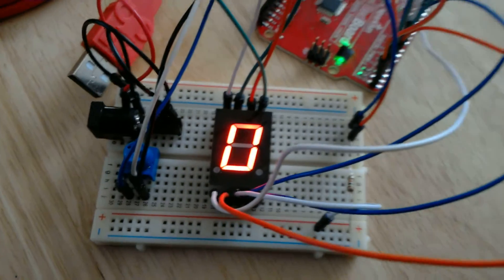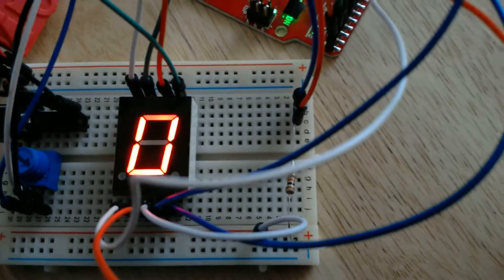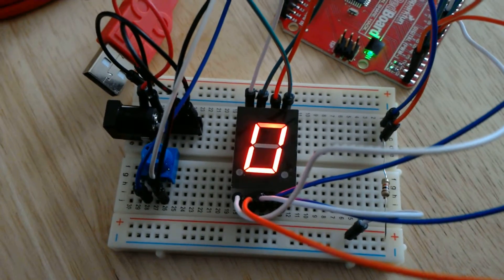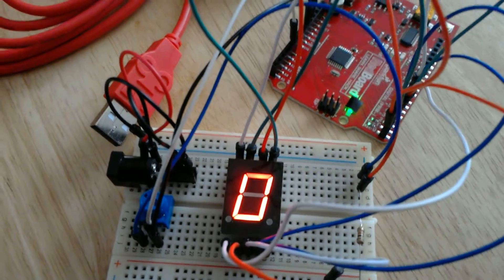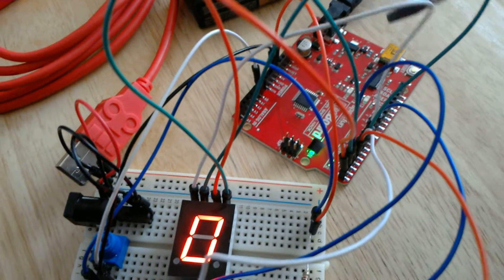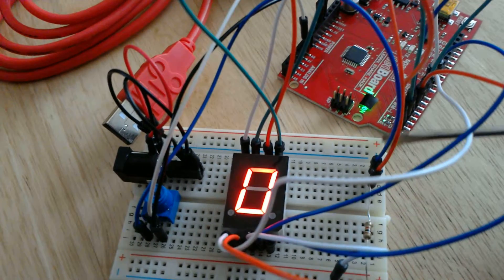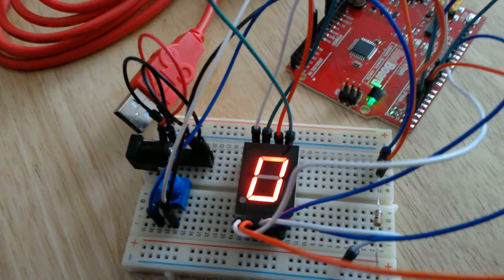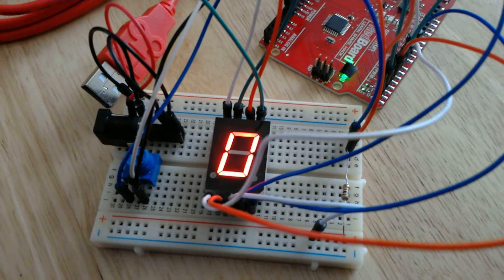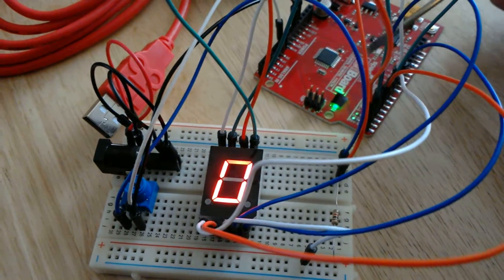That gets the resistor, which is nice — it means you don't need a resistor on every single input, you can just use one resistor. That's a 1000-ohm resistor. I have my power coming in from the board — the 5-volt power — going through the orange wire. I've got one branched off with the resistor and one without. That blue wire goes to the pot because the potentiometer doesn't need the resistor value — I tried it with one and it didn't work as well.